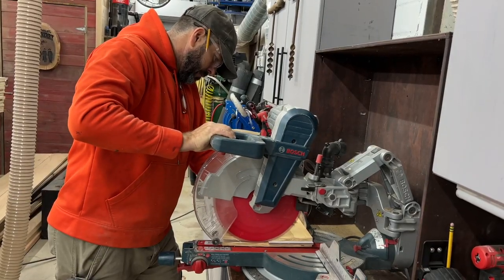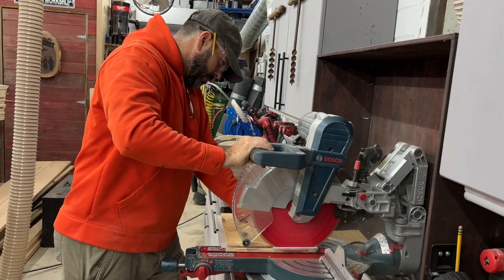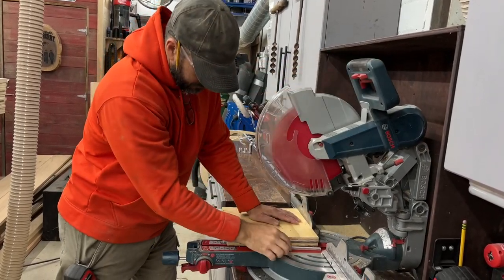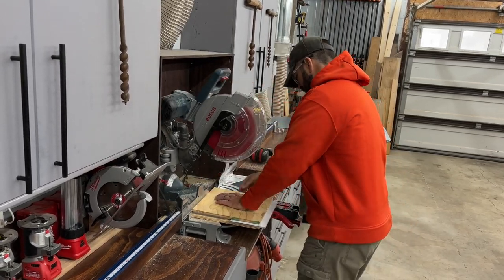When cutting acrylic panels, you have to be careful of chip out. That's the reason I have the panels surrounded with plywood here at the compound miter saw. This keeps the corners intact as the blade passes through the material.